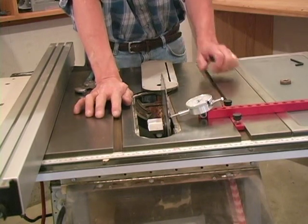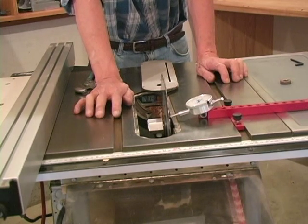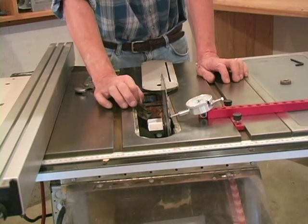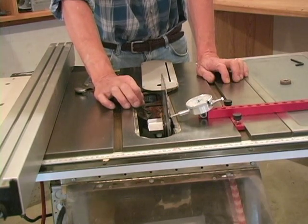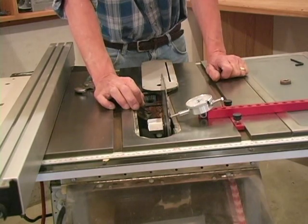This is an extremely nice test to make. If you've got a bad saw blade, there's no way your saw is going to cut right. If you've got a defective arbor, there's no way you're going to cut right. One thing you can do if you see what you think is an excessive amount of run out is find the high spot on the blade and the low spot on the arbor, put them together, and that will minimize the total amount of wobble you see in your saw blade.